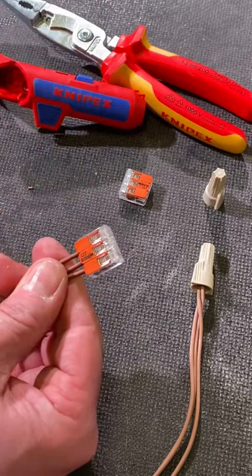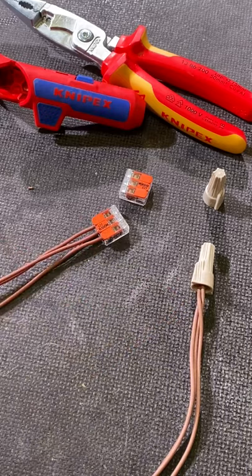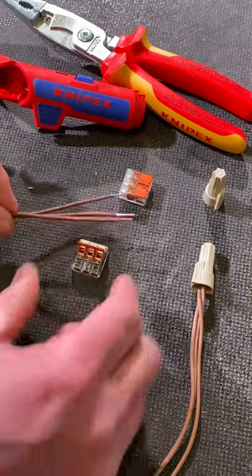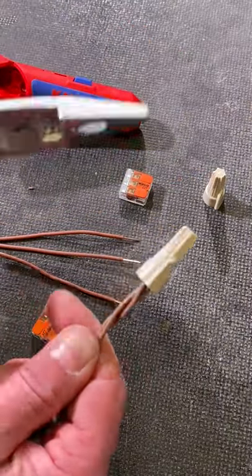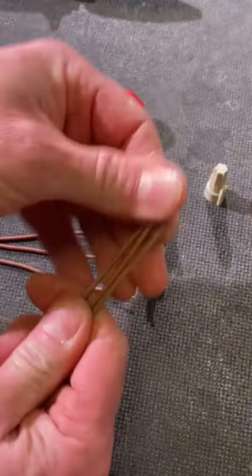So both of them are connected now. What if I wanted to reverse the process? Can I use the wire nut again? I know I can use the WAGO by simply lifting the levers — the conductors are out and I can reuse it, so save that for another time. With the wire nut, I'm going to have to cut it off and obviously replace it — strip back the cables and reinsert a new wire nut.